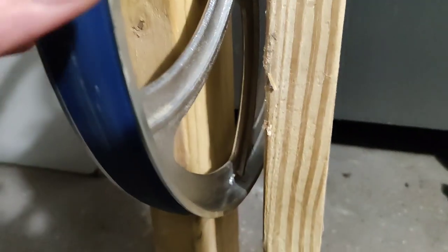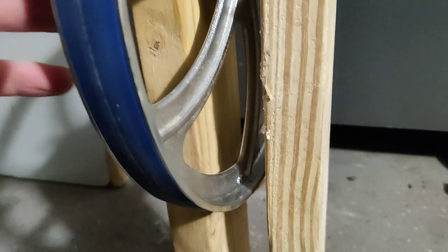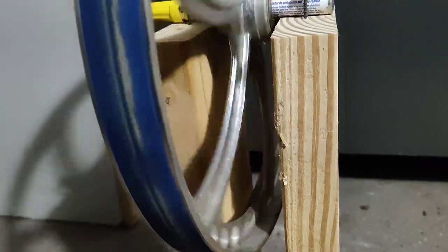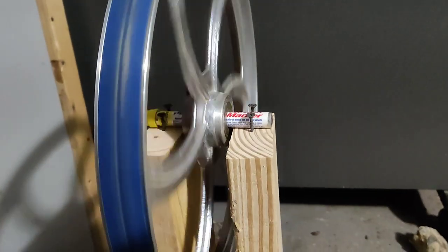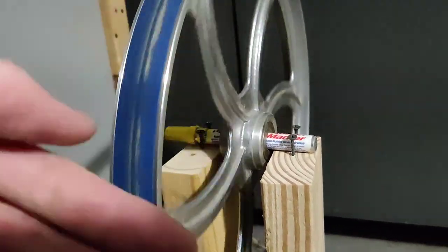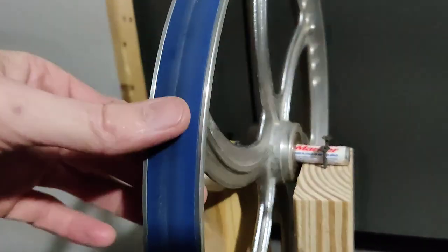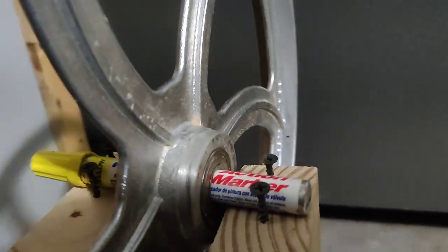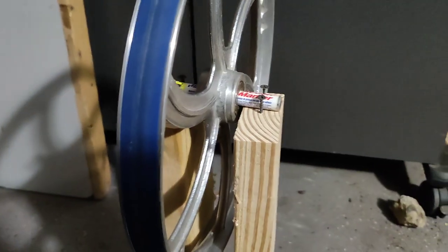There won't be another updated video but you get the point — I'm going to drill one or two more holes and give it a shot. That's how you balance your wheel, and this will take out a lot of the vibration you get when using your band saw. You can see it's already doing a lot better — it's going to spin and spin until it just stops. Thanks for watching, hopefully this was helpful, and stay safe.